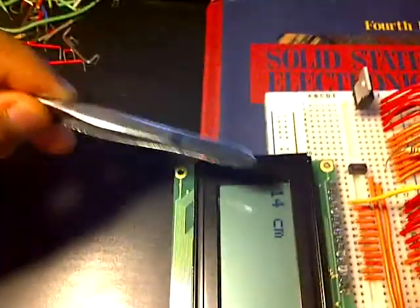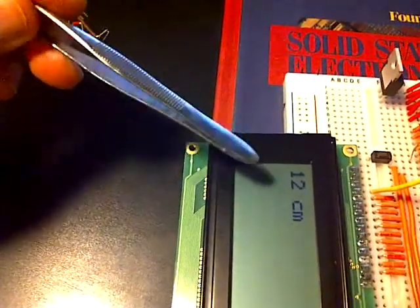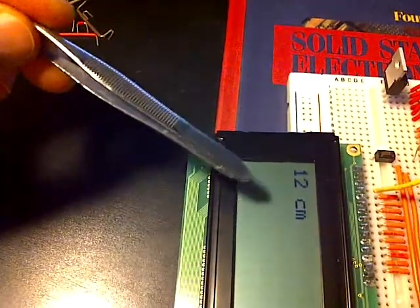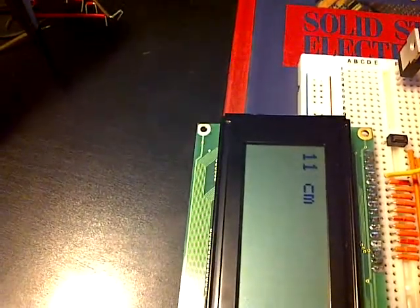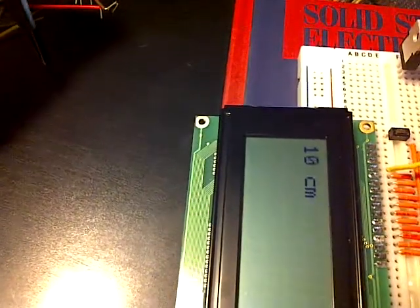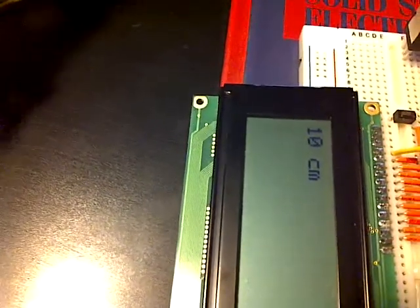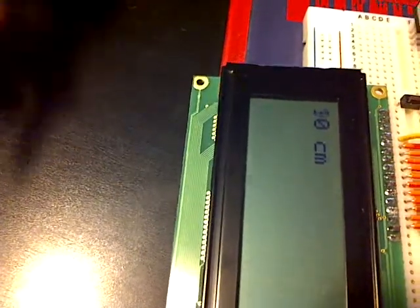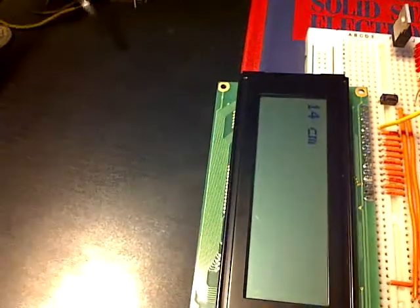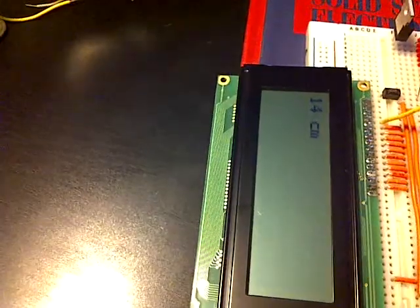to get rid of this delay that I was talking about. Now, I haven't been able to do this yet. To get rid of this delay between changing modes and the number showing up, what I have in mind is to modify the delay cycles so that while the system is being delayed, it also checks whether an interrupt has occurred and changed the mode, so that it skips over the delay and carries on to the next mode. But I haven't exactly thought this through fully yet.